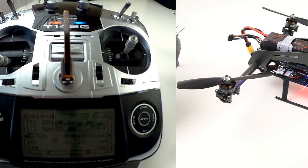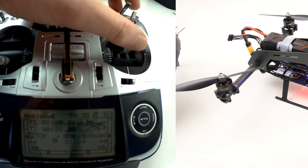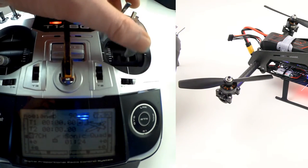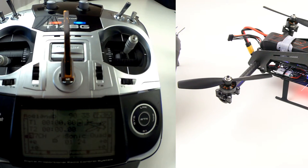The reason for having five percent input into the flight controller is so that if I run a GPS, the quadcopter won't fight this tilt. If I would have no input into the flight controller about my pitch, the flight controller would think the quadcopter is moving forward even though there's no input in that direction, so it'll try to fight me in that mode.